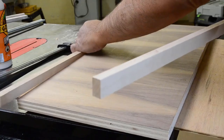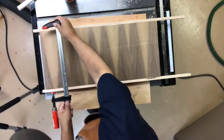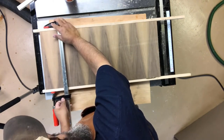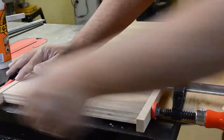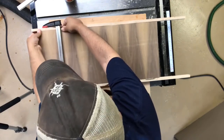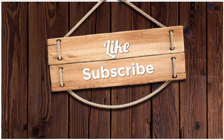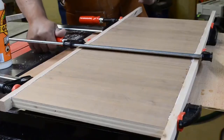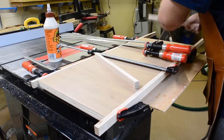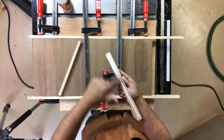Now with the strips ripped, it's time to move on to the glue-up itself, starting first with the long edges. The wrap strips are all slightly oversized, and I'll demonstrate why this is beneficial once the top is fully assembled. I have all the show faces resting face down — this way, as I start adding the clamps in place, I'm able to adjust the plywood to make certain the strips ultimately sit just a wee bit proud of the surface. Trying to keep as even a coating of glue as possible to avoid too much squeeze-out.